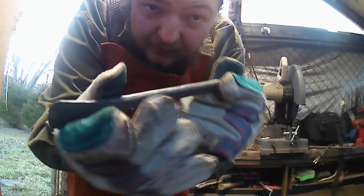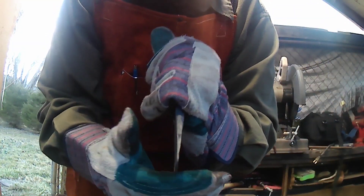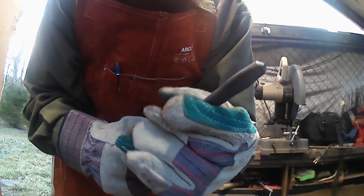She's cooled off enough to handle with gloves. You can see we have our flats for our ovular size that way, and it indexes nicely so we can tell where our edge is going to sit. We're going to true up our crescent shape so we can walk it through the metal fairly easily. We're going to grind a decent bit back because we got a little thin on our edge — this material is a little small for starting a hot cut. We'll grind back until it's a bit thicker, clean up our flats, and clean up our striking end where we cut it on the hot cut.